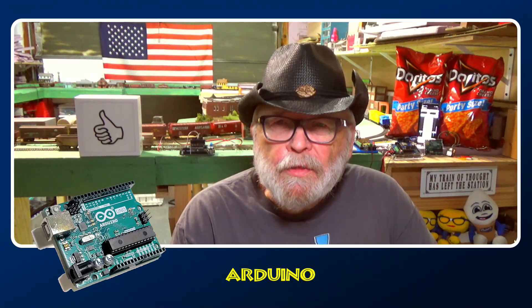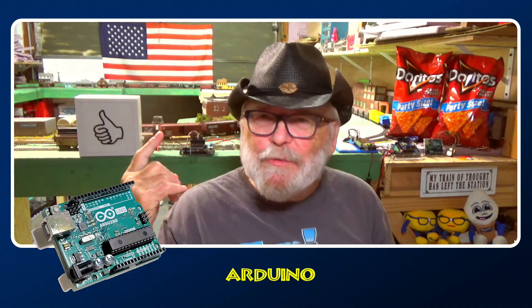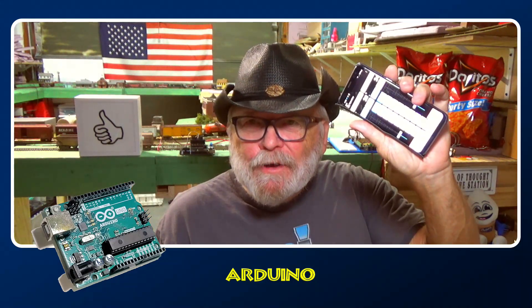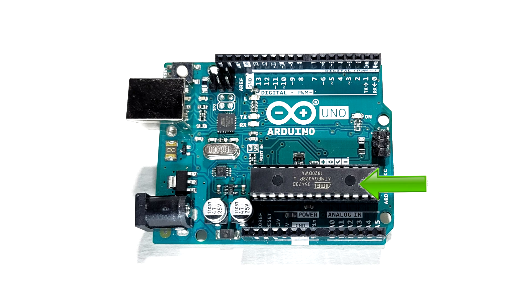Let me show you a few things about an Arduino Uno — we'll start off with that one right there. By the way, these trains running behind me are running off of an Arduino Mega, to be exact. You're looking at a Genuino Arduino Uno. The heart of every Arduino is the ATmega 328P microcontroller. This does all the work for the Arduino, and you don't have to worry about anything about it because that's taken care of in the software and the pins that you see lining both sides of the Arduino. The software is based on the programming language C and C++, but you don't have to worry about that either, because Arduino takes care of all the work for you in the new programming language created by Arduino. They made it simple for everyone.